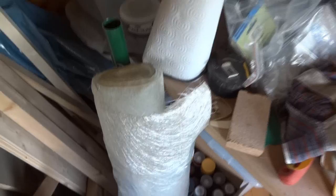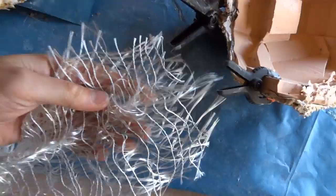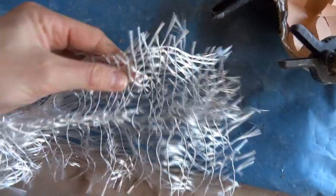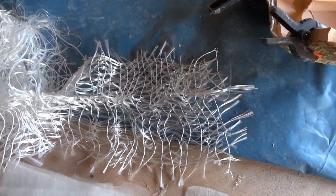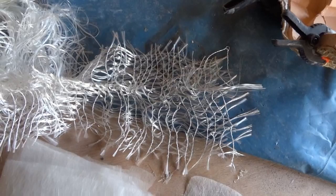If it's not too bad laying them up through those thigh holes, then basically I may well reinforce them with this mat, which is a multi-axial mat. It's called quad-axial mat, and that's obviously a very open weave that's very easy to wet through with polyester resin. So if it doesn't go too badly, I may just go and do everything through the hole in the end of the mould. Otherwise, the plan is to take them out, cut them in half, and then reinforce them. So I'll have to get those moulds off the shelf, and we'll get going with that.